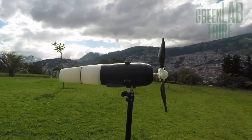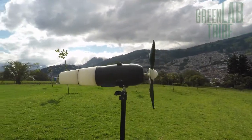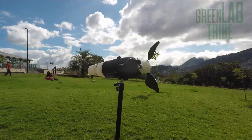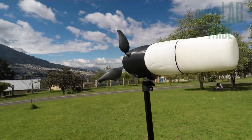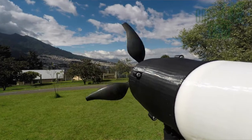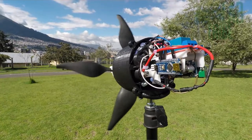There are a lot of things that can be improved. The most obvious is the control unit and the output module — it can only charge devices that work under 1 amp, meaning USB-C type devices cannot be charged. I also need a power on/off button, because right now it's draining power from the batteries all the time — if you want to store it, the battery will die very soon. Even so, the turbine works, and that was the goal, so I'm very happy with this thing.